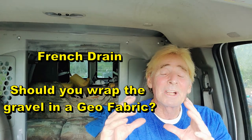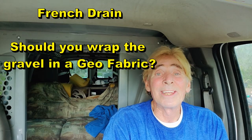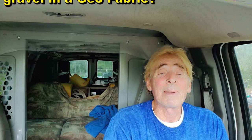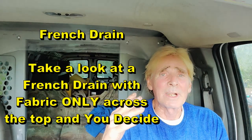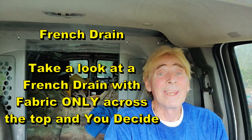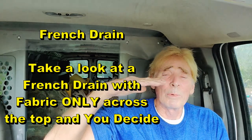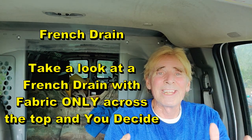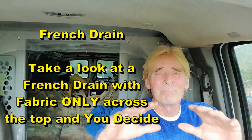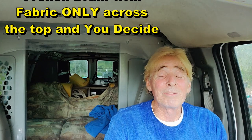This is a clip from a very long video, but it exposes the truth about fabric. I would love for you guys to comment, but this is proof about what I've been talking about. Even in the sand, you do not need fabric. Do we wrap it in the sand? Of course we wrap it in the sand. But in the clay, this is the absolute proof. I'm going to cut open this French drain — you'll see all the gravel. You'll see there is fabric on the top, which is what I like to do. We lay fabric on the top of the gravel so that the dirt doesn't drop down in. But we do not wrap it. This burrito thing — we eat burritos — it doesn't work. And if you're doing this and you don't add a catch basin for some type of surface water collection, you're going to have major problems in the future.